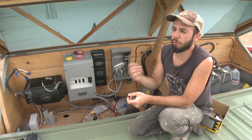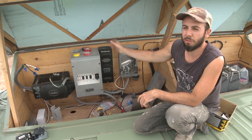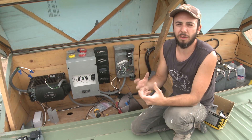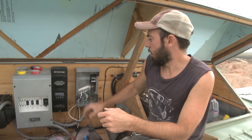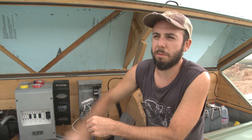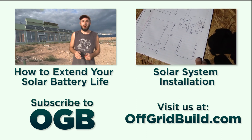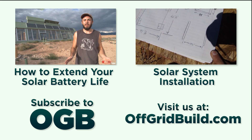This is especially important if you have long cable runs. My longest cable run is 35 feet for the inverter and load center DC and AC runs down to the breaker boxes inside the house. With number six wire, at around 70 feet the resistance increases to the point where a surge protector farther down the line can no longer protect equipment 70 feet away. So you need to space them out throughout your system if you have long runs. On another note, my batteries are not in great condition — they were sitting unconnected for one period of a year and another of six months with no battery conditioner.